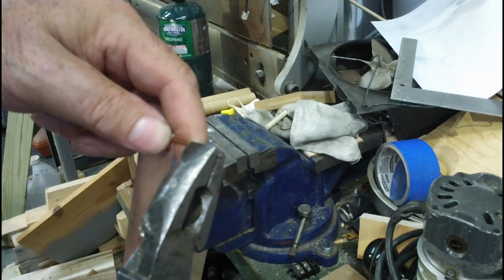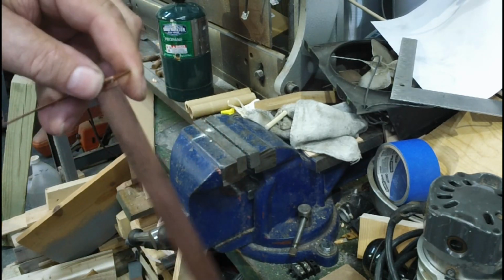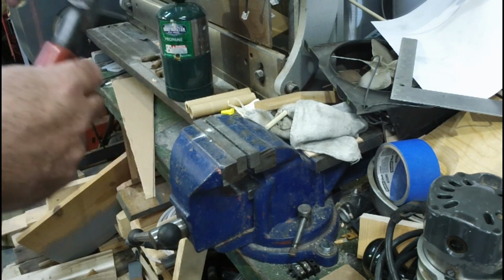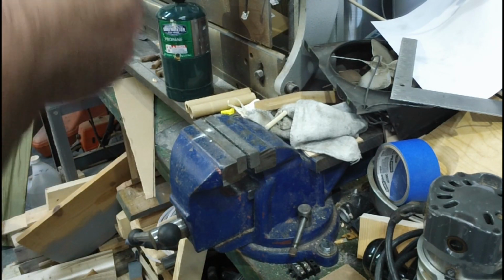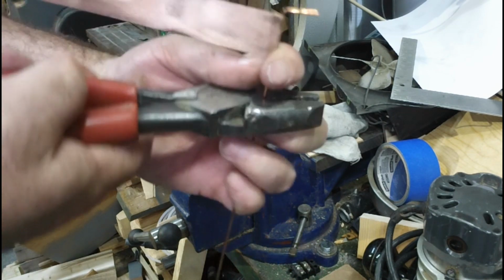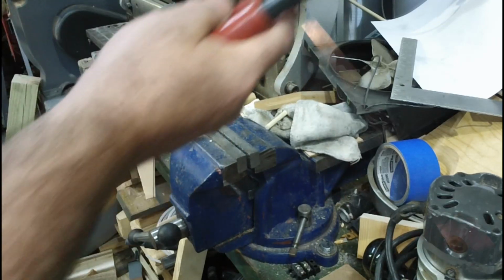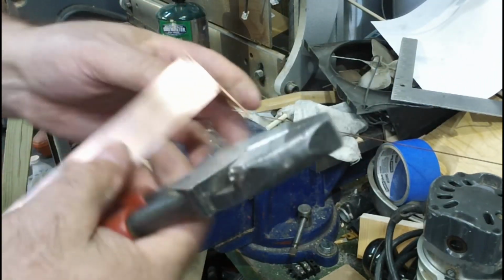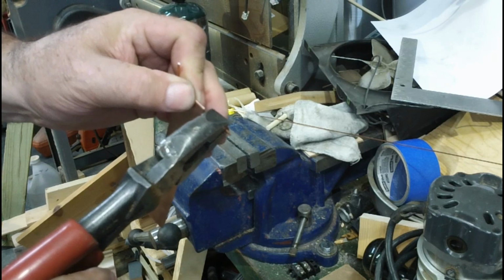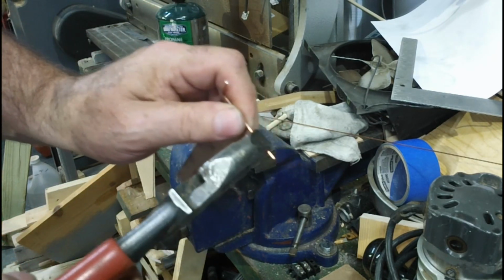And you could, like I said, use a piece of a tin can for that matter, but it does need to be something that conducts electricity fairly well and something that you can solder to. I use copper because it solders well. A tin can would work just as well. It does need to be reasonably heavy. You wouldn't want to use something paper thin, but you can see how the hinge action works there.